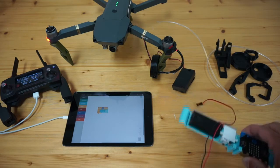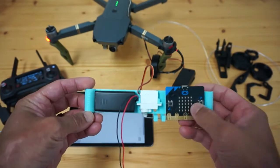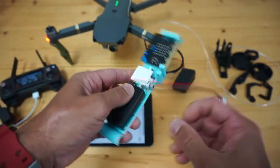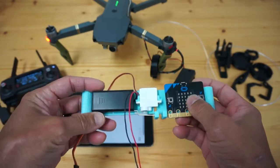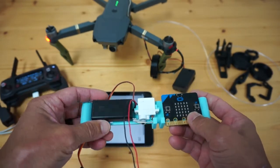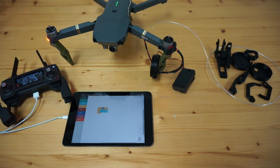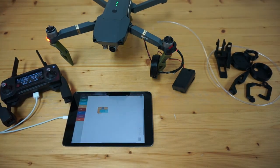If you've followed my channel for a while, you'll know that I've tried various ways to create a payload dropper. This was one of the first ones that used the micro bit board. It mounts to the Phantom 3 and 4 landing legs, and it would detect a 360 degree rotation, trigger the servo, and drop the payload, but it wasn't very consistent. There were a lot of issues with vibrations triggering sensors on the micro bit, and my 3D design skills are very amateur. So I want to fast forward to what the Ruiz brothers have done and what we're doing to integrate this payload dropper into drone blocks.